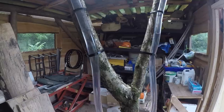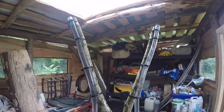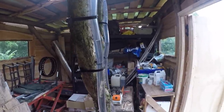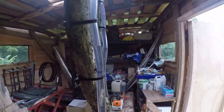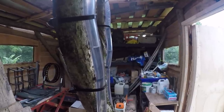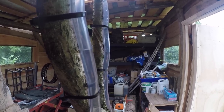Okay, so can you see the water level in there? If I tip it, you see it moves. Nature's level, that's all you need to survey, and you can get quite a good level of accuracy with that. So what we do is we sight down it. I'm going to try and do this while filming. You sight down it with your eye, line the two points up, somewhere like that. And then wherever those two points are pointing, that's your level. Now, you obviously need a measuring stick on the other end, which we're going to make next. But where those two points are pointing at is the level.